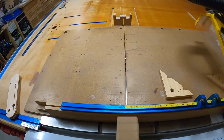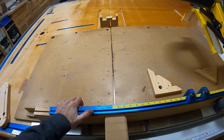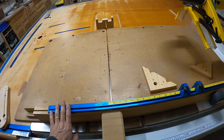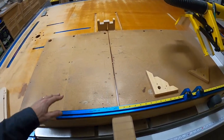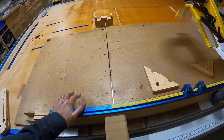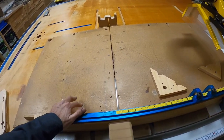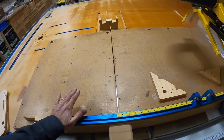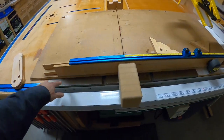Having a replaceable insert that you can move toward the blade — I just don't think that's an important feature. So if I were to design another sled — which I'm going to be building one soon — this sled has been in essentially this state for about 18 years, so I'm probably going to be changing it out. I don't think I'm going to have a removable piece. I think I'm just going to go straight five-eighths ultralight MDF.